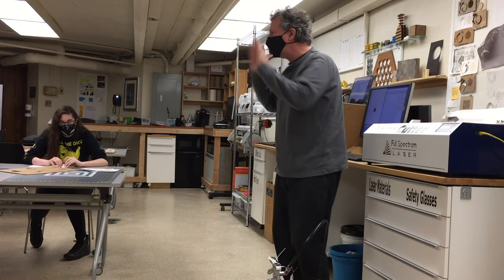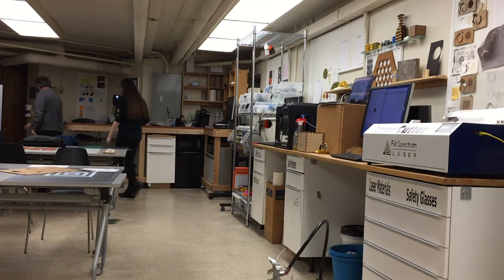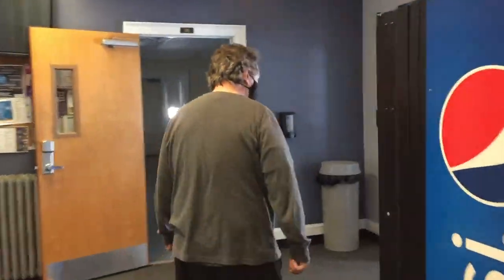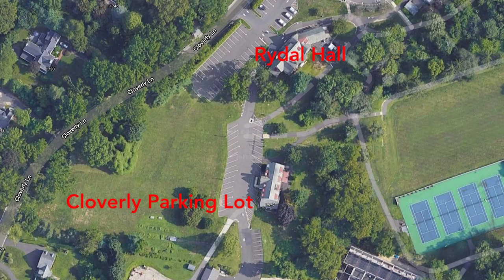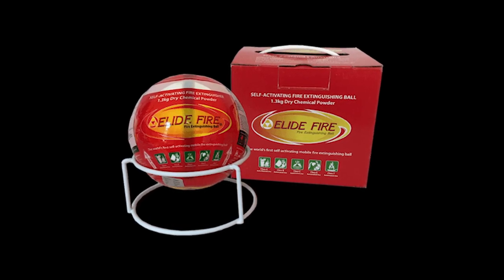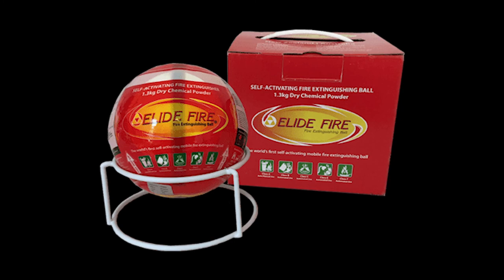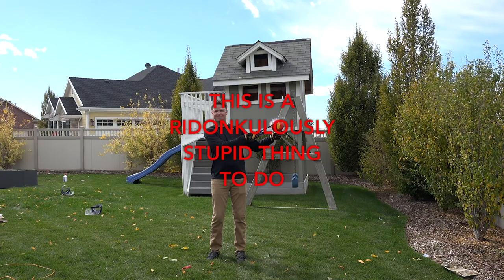If that doesn't work, it's time to warn others and evacuate. Announce loudly to everyone that all must exit. As you exit, find one of the fire alarms located along the egress path and pull it, then get out of the building. Our rally point is the parking lot to the south of Rydel. Make sure everyone who was with you in the space shows up to that rally point. If you see someone missing, notify a first responder that someone is not accounted for. There's another layer of protection — the red fireball located above the machine. This is a fusible fire suppressant device that will rapidly deploy when touched by flame and save other equipment in the room. It won't harm you if it activates, but you want to be long gone before this baby has a chance to do its thing.